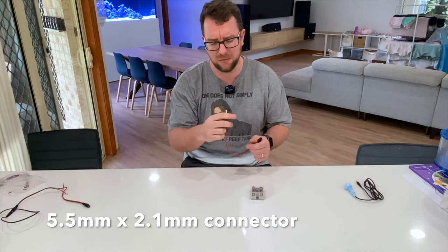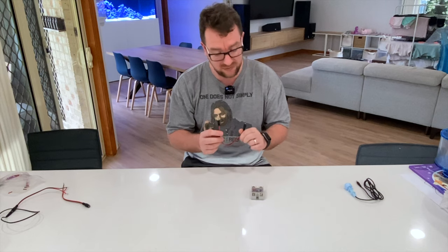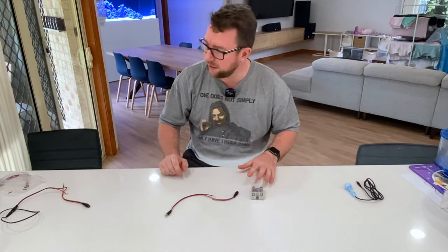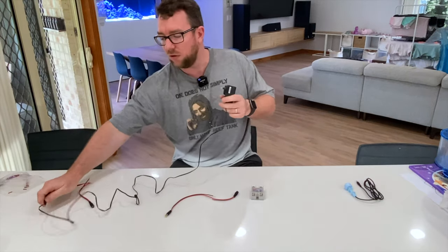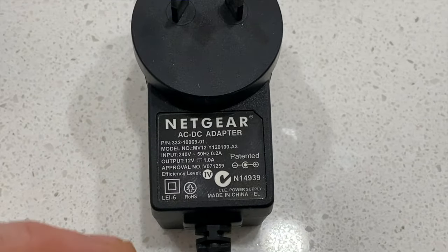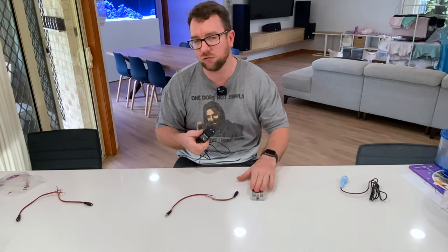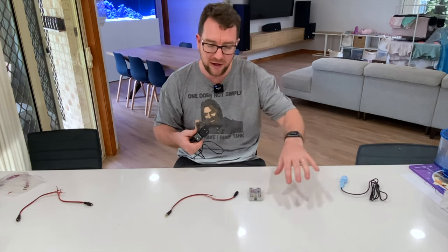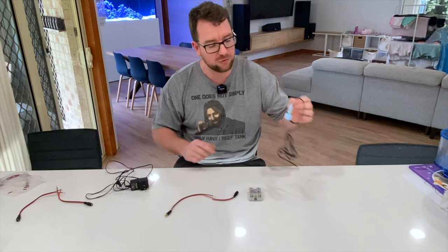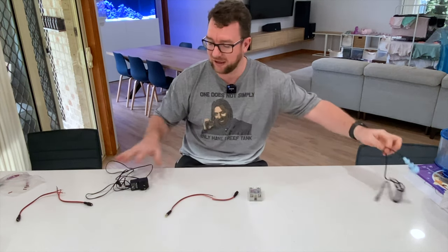The connectors are normally 2.1 millimeter inlets. I'll put some links to the connectors — you want the males and the females, maybe three sets just to make sure you've got enough bits and pieces. There's one more component you're going to need and this is the part that most people get caught out on: you are going to need a small DC power supply. This one's a Netgear — it's an AC to DC 12 volt 1 amp output supply. The reason we want this is it's what's going to put the power through our float switch and back down to the controller, telling this relay when to supply power to the skimmer and when not to. We don't want to switch the skimmer power itself through the float switch — these little float switches just cannot handle that kind of current. You can try it and you'll burn it out quick smart. You have to have a separate power supply.